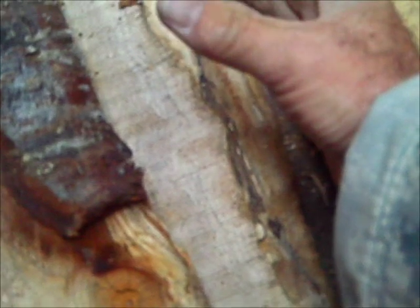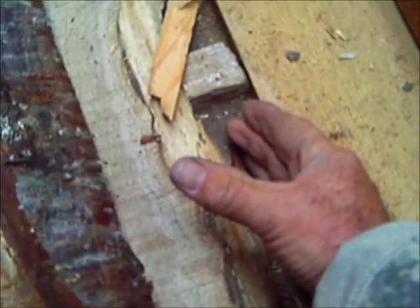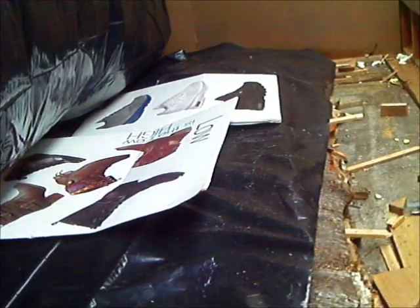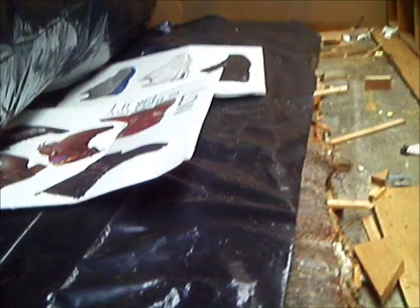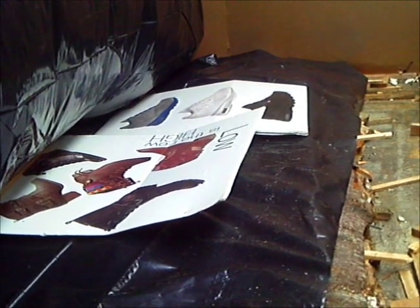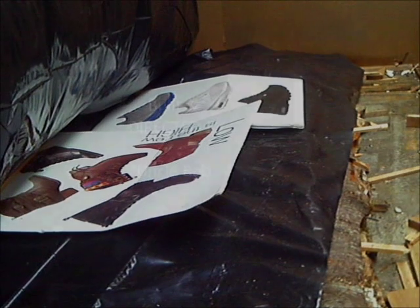You can see the black plastic is puffing in because it's trying to get through the little bit of stack I have here — basically a sticker on the floor and then one sticker on top of that. Feeling down here, I'm definitely getting a flow of air through the bottom of the stack, so this is drying out my firewood. I haven't cut anything to put in it yet, but I think that'll be the next step. I pretty much have everything sealed so I think it's ready to start up and go, but I do want to cut up this wood into firewood, get it in the shed, let it dry a day or two in here while I get ready to cut my maple.